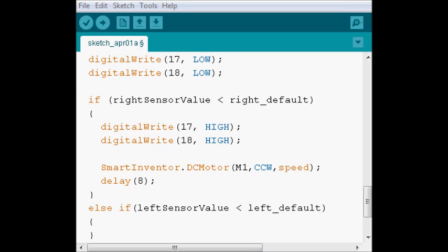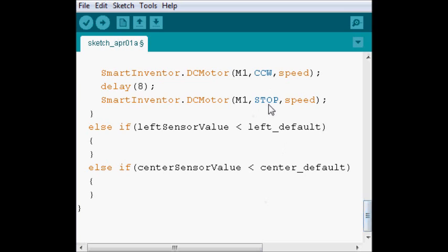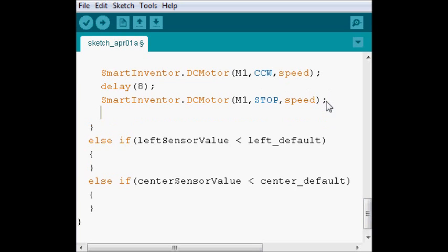And then we're gonna tell the robot to stop. In this case, we're telling it to stop instead of loose or something else. The reason being is stop makes it so that each pin is written to high. What this does is make the wheel a little bit harder to turn. It's not impossible because it's not a complete brake. But for our case, it's good enough.